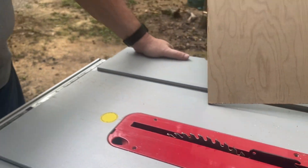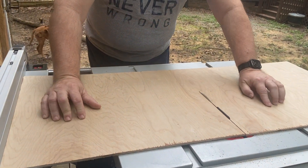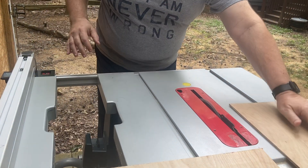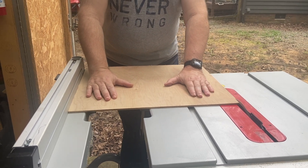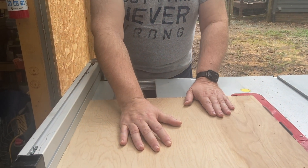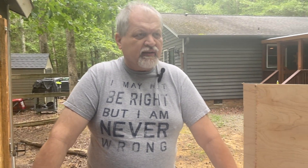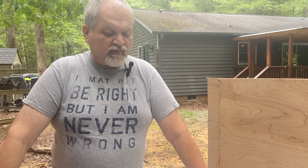The next part is to cut it to width. For this cut, make sure your hands are on both sides of the blade and apply equal pressure so the piece moves along at the same speed on both sides. Have one edge touching your fence and use that as your reference point. When you finish one piece, use the other piece to verify they're the same dimension. There was a very small variance, but now the two pieces are exactly the same and we're ready to proceed.